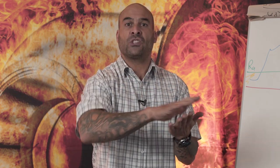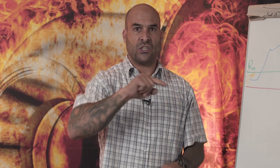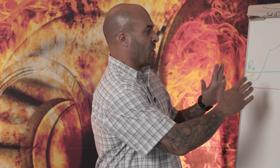And once you zoom in, that surface roughness will basically depict peaks and troughs. Now, when we speak about RZs, just for want of another explanation, yes, it's not 100% correct, but think of the peaks. When we speak of the RAs, think of the troughs. Okay, so any material that you machine will have a surface roughness. It's going to be easier for me to explain as I zoom in on the microscope. But before we do that, I'm going to actually show you a photo.